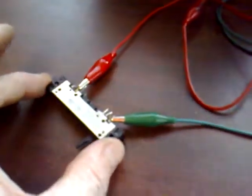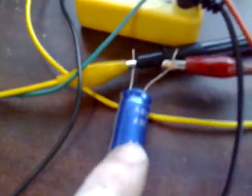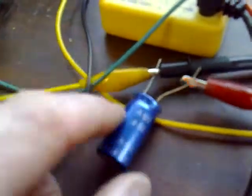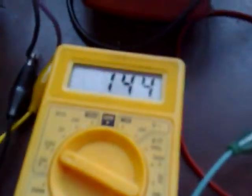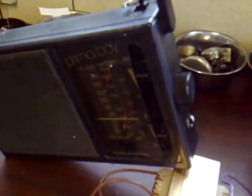We've got the 22K pot here. The transistor is a 3055, and that's probably the best transistor to use for this. We've got an LED across the base emitter, from emitter to base. We've got a super cap here - it's a 2.5 volt, 20 farad - and it's charged to 144 millivolts. We've got an amp meter measuring across a 1 ohm resistor. I'll switch the radio on now - I use it a lot to hear the thing running. It's quite amazing to listen to because the frequency starts low and then goes higher and higher. So I'll just start it up.